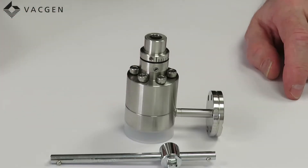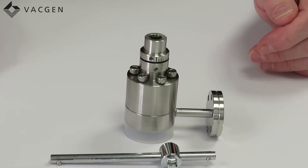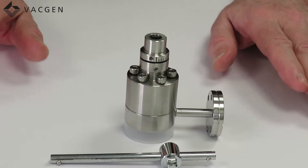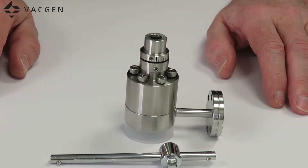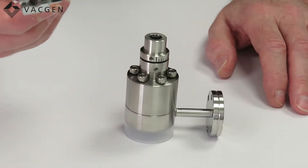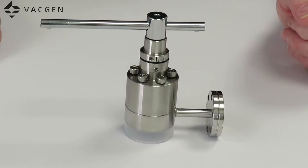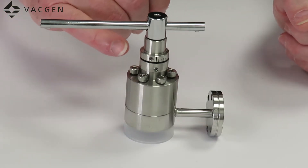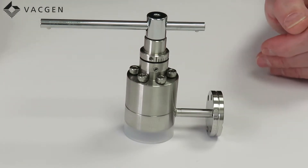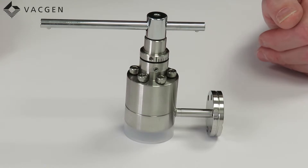This is the MD95, which is the small version of the leak valve. We do sell quite a few of these, but it is just a coarse valve — you don't get the control that you get with the LVM. It is simply operated by a T-bar that pushes into the top, then you turn it to open and close the valve. You can use the graduations on the side to see whereabouts you are, and having said that, it is quite controllable.